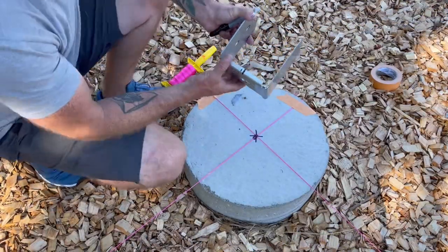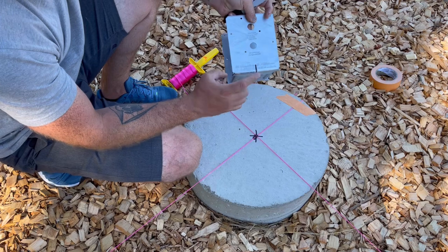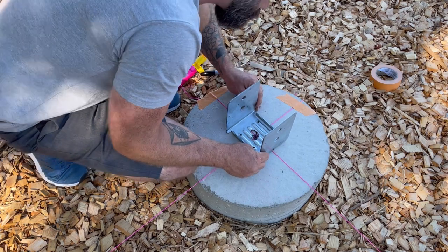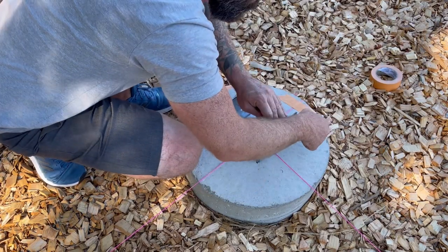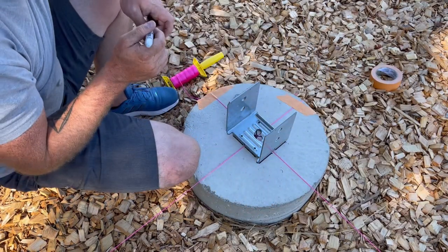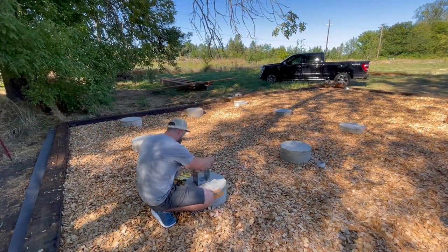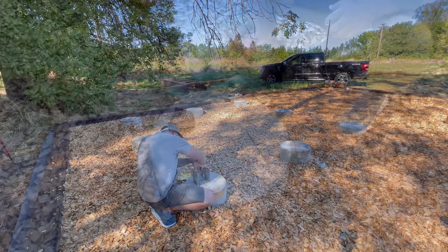To make sure the brackets would sit square to one another, I measured the middle of each bracket and added a little Sharpie mark. I laid the bracket down on the string line and made sure those marks were on the string on all four sides, which confirmed the bracket was perfectly square. Then I traced out the outline of the bracket with the Sharpie so I'd know exactly where the brackets needed to go once I added my anchor bolts — a nice little outline so I could plop them back in place knowing they were all square.